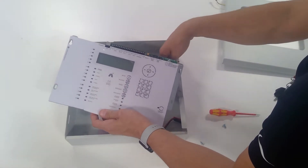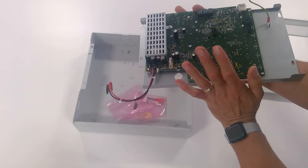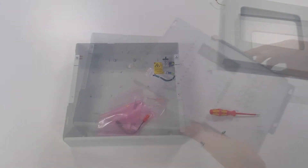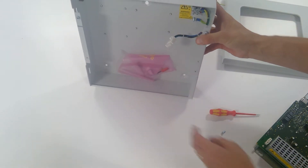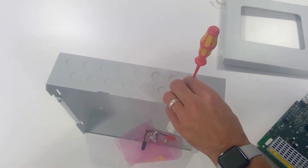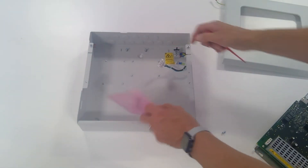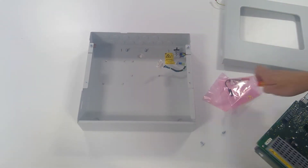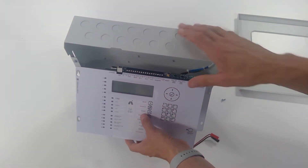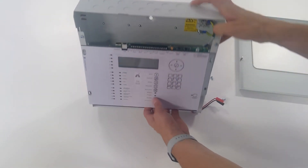Always be wary when installing any electronic product — remove the electronics first. It's a common board solution with the power supply, relays, main circuitry and main processor all on one board. Be wary of drilling the back box; we do have knockouts — just place a screwdriver on and tap to remove. There's also a nice feature when the panel is hanging on the wall allowing those with big hands to get in and manage cable entries while the chassis hangs in place.